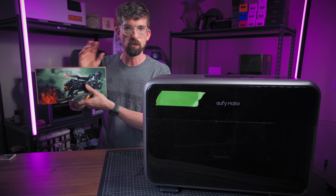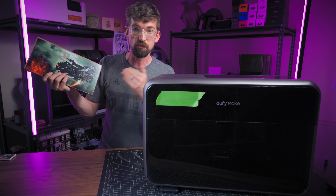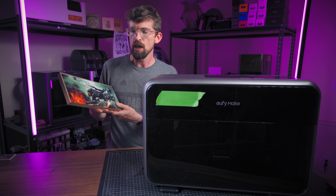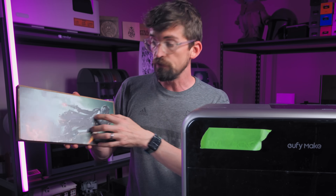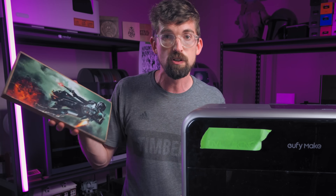What makes this unique and why this is a UV printer is it comes back with a UV light and actually cures that ink directly on your material. With a normal inkjet color printer, you can't print onto wood or metal because the ink needs to absorb into the material. But with this, the ink is actually on top of the material — you have fully cured resin sitting on top of your base material.